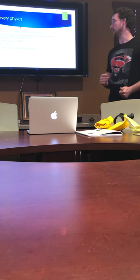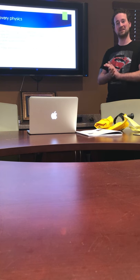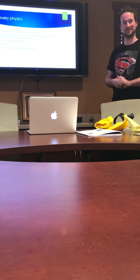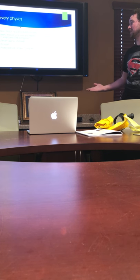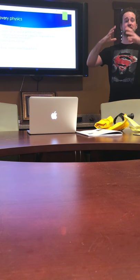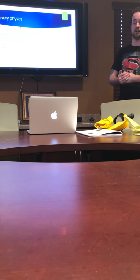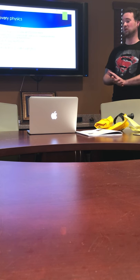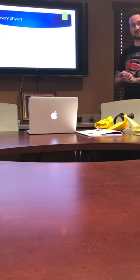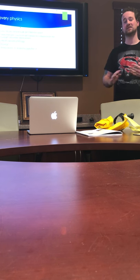Now the physics of the recovery. Boyle's Law: pressure and volume are inversely proportional — P1V1 = P2V2. As pressure goes up, volume goes down and vice versa. This applies to the air inside the lift bags: as the lift bag goes up, the air will expand because there's less pressure. Archimedes' principle is the buoyancy principle — an object's weight in water is equal to the water it displaces. This is used for calculating the lift capacity you're going to need.